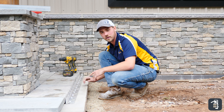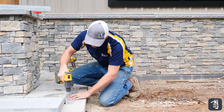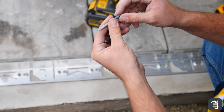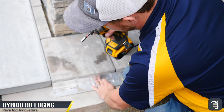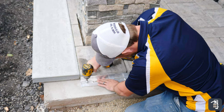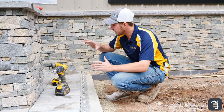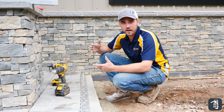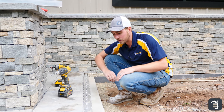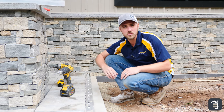This here is just a front entrance way to our new building, so we're just going to be leaving those tabs down. Now what we're going to do is, using a drill with a concrete bit, we're going to drill these and install a tapcon two-inch screw — you can use anything you really want here depending on your application. Use your best judgment as far as how many tapcons you want to put in the edging. In this application it's a front entrance way, people are walking in and out, not a lot of lateral shift, so I'm going to probably do every other one of these V's. If you were doing a driveway, I would probably do every one.